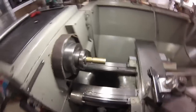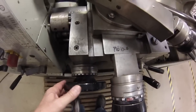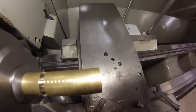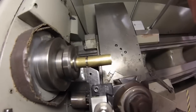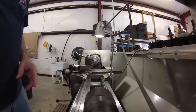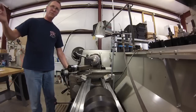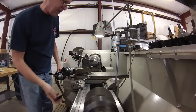Check this out. I'm putting this machine in reverse for this particular thread. Tool is on center. Upside down. Running it in to the stop. I always like to adjust my hand wheel so that it's on the downside of the weight, so that if there is any slop in the carriage and it decides to move, the weight of the hand wheel is going to keep it against the stop. This is where you would normally be squinting and clamping your butt cheeks together as the tool is approaching the undercut, because you have about a nanosecond to disengage the half nut. Well, check this out.